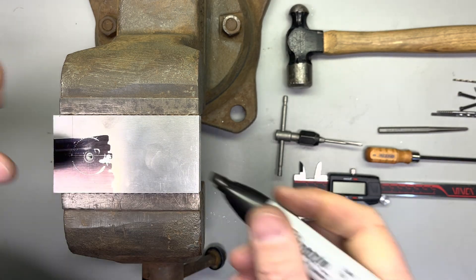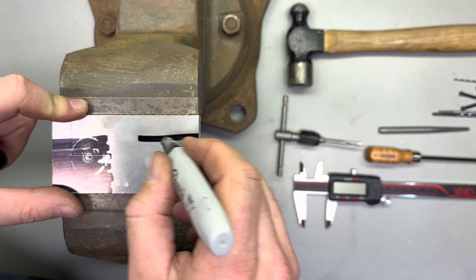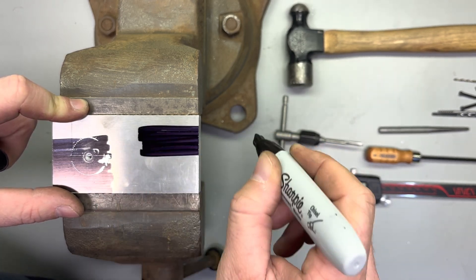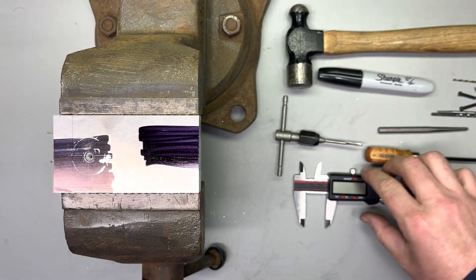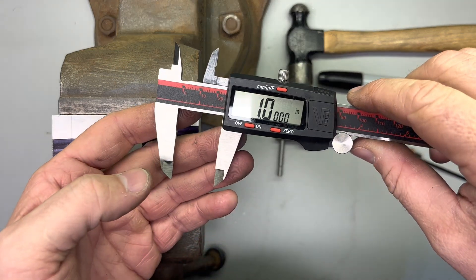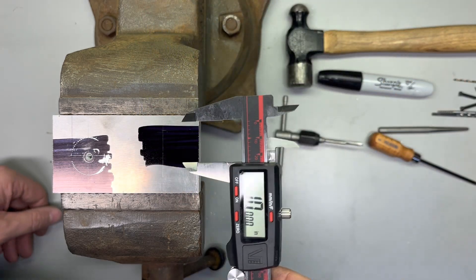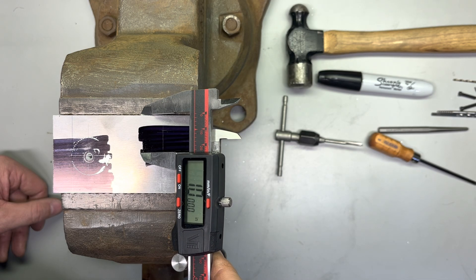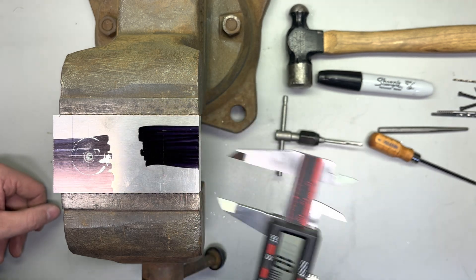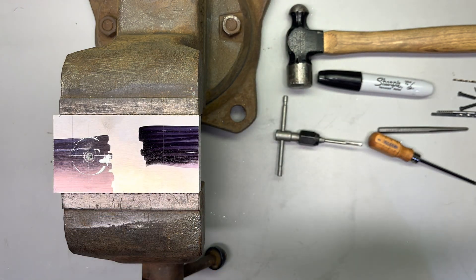The first step, if we're going to be drilling a hole in something fresh, you'd normally use blue Dykem if you were a machinist, but I don't have any. I have a Sharpie and that works just fine. We'll use our calipers — I've already got those set exactly to one inch, just an arbitrary number I picked for lining this out. You make your one-inch mark, put one end of the calipers on a nice square machined edge, and you can see where they cross. That intersect point is our one-inch by one-inch setback.